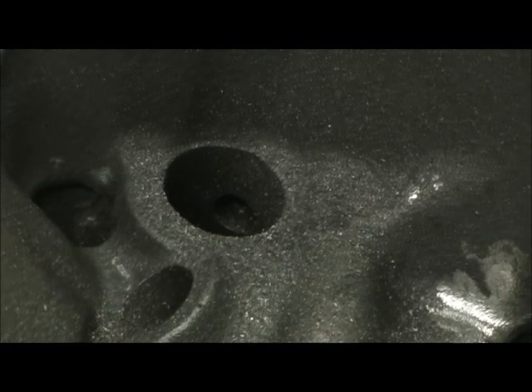What we're looking at right here is the hole on the rear galley where it runs into the distributor. I go in here with the grinder and radius and roll all that back. Here's what a lot of people don't know - your MSD distributors and different aftermarket distributors have O-rings in them with very tight clearance. You've got to go in there with a grinder and radius that hole so that it has a blend to feed oiling around it.